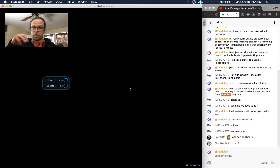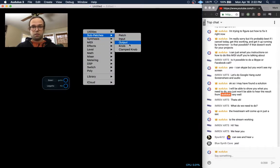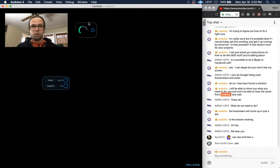And then they need to electrically connect inside of the Arduino, which is a little box that translates these signals into code that the computer can understand. Then there's a little program that you can write within it that you plug into the computer, and it basically looks at the Arduino device as if it were a keyboard, which is why we're going to use the keyboard node. And it will send pitch information and note on-off information. Depending on how you have it set up, you can also send information to knobs, and then you can do MIDI CCs, control changes.